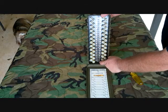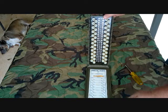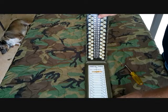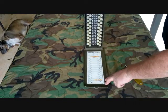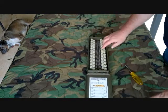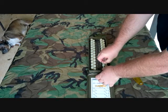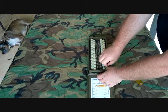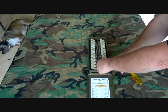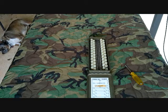They actually had little patch cords with double plugs so you could reroute field wire connections — for example, reroute two pieces of field wire on this side to two pieces on the other side. It's a handy little box. Down at the bottom there's a chart where you can annotate using a pencil or grease pencil to record phone numbers or circuit data. The binding posts themselves are push-button type. You push the binding post down, insert the wire, release — then fit the wire into the little notch with the rubber piece in it.